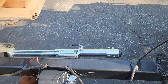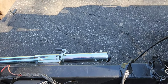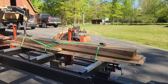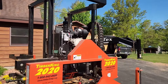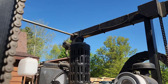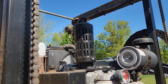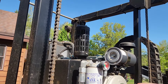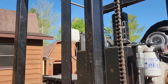Unfortunately, our breakaway brake here — the dogs did a great job of cutting some cables on that, so that will not be used. We'll get that fixed whenever we get back down to Tennessee. There is one more thing: I went ahead and had my son get up on top here and tape up that exhaust right there. When you get this from Timber King, it usually comes with a flapper on top of that — I can't stand a flapper, so I take it off. But just in case, depending on how long this is going to sit, I don't want any critters getting up in there. Just make sure when I first crank this thing up to take that tape off, because there's going to be a lot of pressure built up in there if I don't.